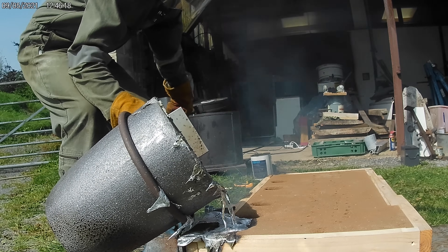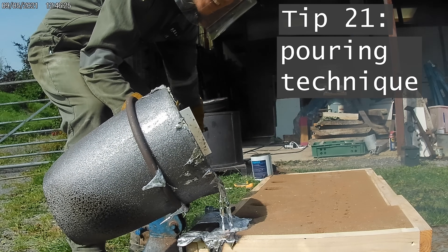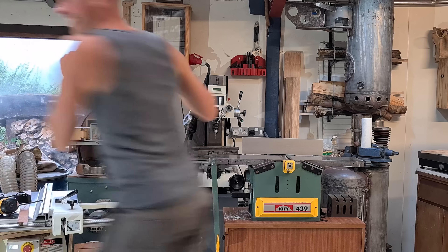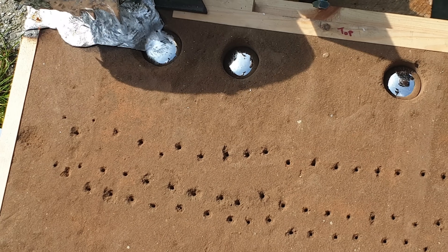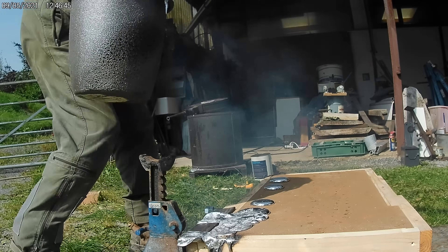Stay calm and deal with the non-ideal situation as it unfolds - I've got two streams! There's plenty of slopping and spilling, a lot of it due to the crucible just being so full, which makes it much harder to control as well as being very heavy. You can verify this yourself just by pouring a very full jug of water. There is no chance for do-overs or hesitation once you've started pouring - and I guess that counts as half a tip in itself. This is the biggest casting we've done and it did require us to fill the crucible right to the top. At least there was enough in the crucible to fill the mould - that's one good sign.